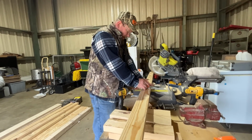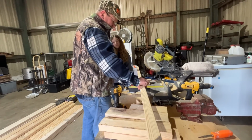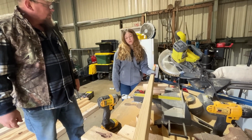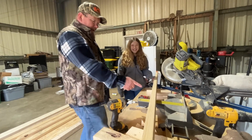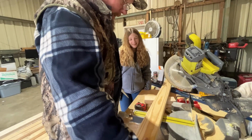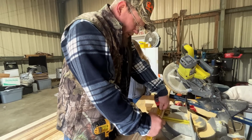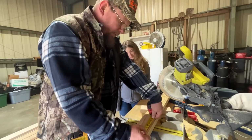So I want you to work this out in your head, okay? Point to point, okay? The problem is I need a 45-degree cut from that point that goes back like this, right? So you have to cut 1.5 inches off? I'm gonna go 1.5 inches back from here to there. Now, the easy way that I like to do this is to transfer, okay? So I'm gonna mark it 1.5 inches shy, which is gonna be 31.5, see that? That gives me 33, 1.5 inches, right?